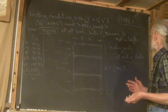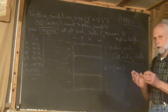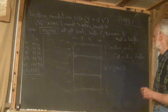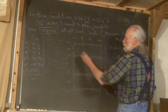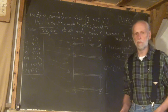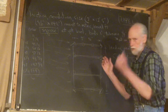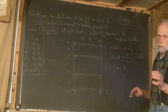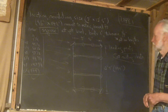Now, the way you make it square — any carpenter is going to know this: your rectangle is square when the diagonal dimension in one direction is the same as the diagonal in the other direction. You'll need a 16-foot tape measure and another person, because it's very awkward to do with just one person. Adjust things until those diagonals are equal and you've got it square. The quarter-inch tolerance I'm giving is not on the lengths of cuts — that's on the thickness and width of the various materials.